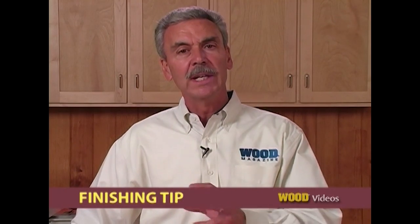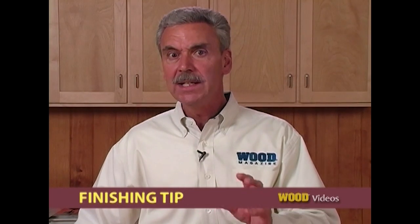Now, you may be wondering whether or not you can use an HVLP gun on your compressor. The fact is you can. A lot of manufacturers now are making highly efficient HVLP guns that work off your compressor. Now the pressure in those guns will be closer to maybe 25 pounds or 20 pounds. When we're using an HVLP system, it's only 6 or 8, but you bet you can definitely use an HVLP gun with your compressor.